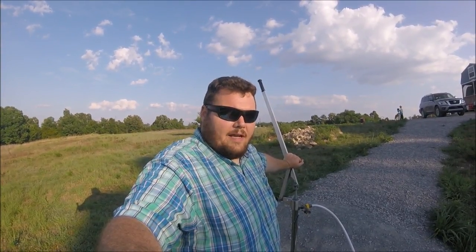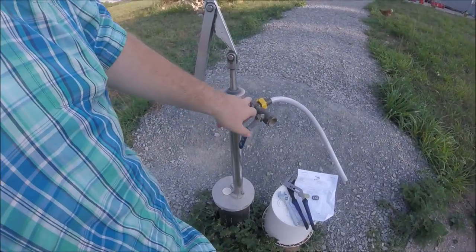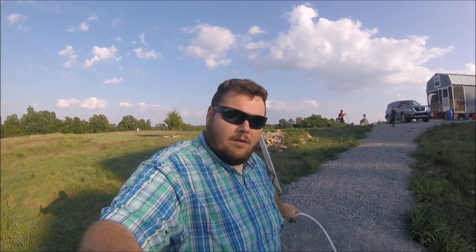What happened is that during wintertime, your well water and your spout — whatever spout you've chosen to hook to the threaded port on the front of your simple pump — the spout can freeze if there's water sitting in it. I was using the one-way check valve as the spout and water froze in it. The one-way check valve then became blocked. We were having trouble understanding why we'd come out during wintertime to pump and couldn't get water, so we were forcing the pump. After pouring water on the spout and playing with it, we'd finally start getting water.